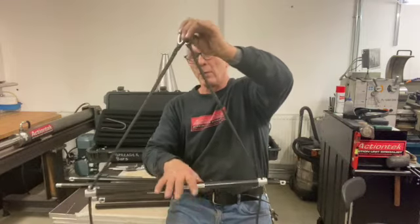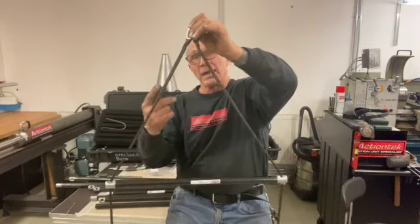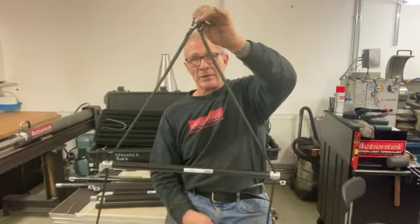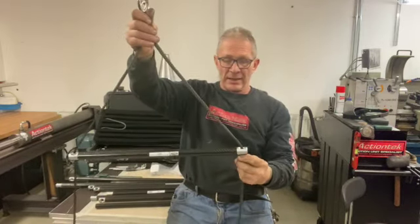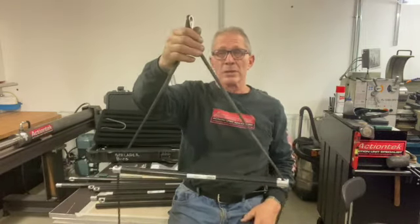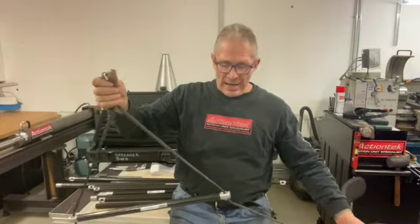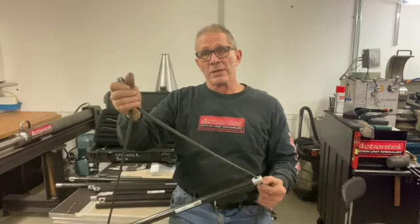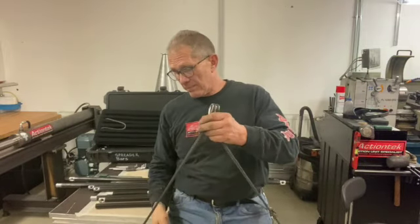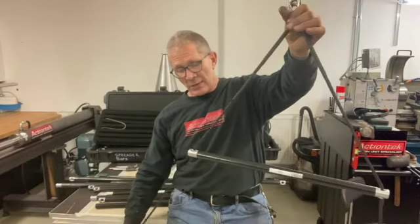60-degree triangle — you're set. The bar can't go anywhere but up. Because the pressure is all in compression, it's not going to slide up the smaller triangle. If it were turned over it would eventually drop off down the straight lines, but because it's in tension and wedged with rubber grommets into the holes, it can go nowhere. There's nothing to rattle — it's quiet, simple, easy. You can adjust it at a moment's notice, change lengths, drop the bar lower if you want less of a bridle. I typically run the shortest 60-degree bridles on everything.